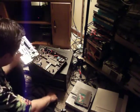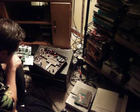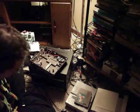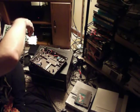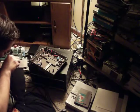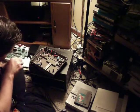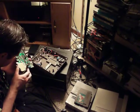Now we're going to take our tool and take this. Here's the point of orientation — it's the 3193A, 1995 Nintendo, 9039A. This orientation dot right there — if you can see it — means that's pin one. So they say count over four spaces: pin one, two, three, four — kind of toward the middle of the chip. They say you're supposed to snip that. And that's what I'm going to do. Snipping this one pin is supposed to disable the whole chip and keep it from being a problem.